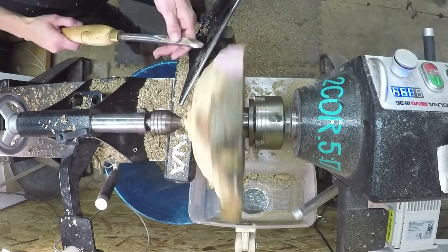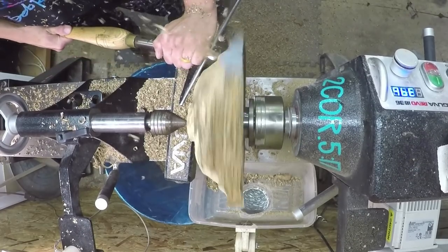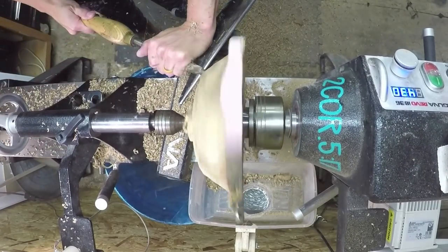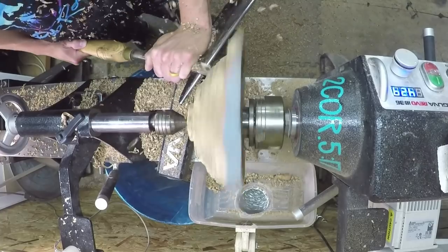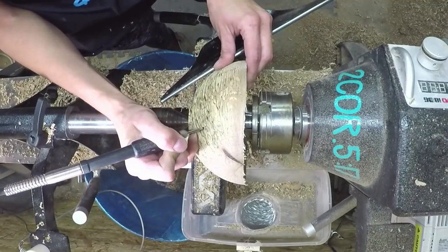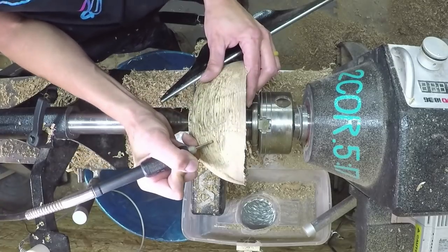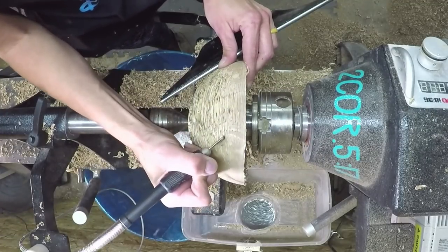These odd-shaped cuts aren't too terrible as long as you get a technique down. I didn't have a bandsaw for the longest time and cutting with a chainsaw round was absolutely not one of my talents. I've learned to do this scooping action — once I get up towards where the rim of the bowl would be, I move with my body and my gouge in a scooping motion. That keeps everything steady and since I've done that I've had a lot less catches and more efficient material clearing.